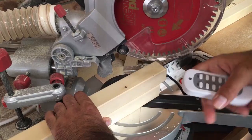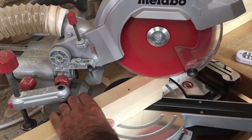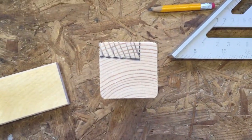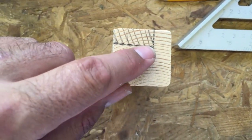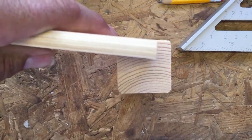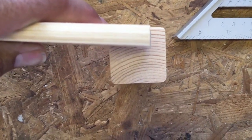These are the two long portions of the seat so I'm going to cut them both at the same time to make sure they're exactly the same. I've marked the end of this board — I've exaggerated the angle a little so you can see what I'm trying to achieve. I'm going to cut a straight vertical cut and then an angled cut which will form a little rebate to accept the slats. Because those slats have a very slight curve to them they'll sit in there nicely, and I can get a screw fixing through the slat into the frame.